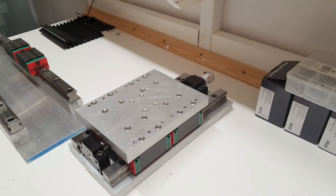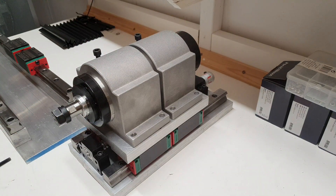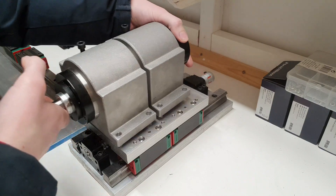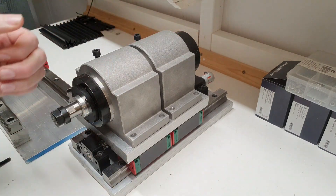These four holes I forgot to make — I don't know why, but I guess my brother and my father were watching what I was doing and I was a bit out of focus — so I did these four by hand, but it worked out great as well. If we place the spindle and the spindle holders, it will look like this. I need to drill one hole in the middle on each spindle holder on each side. But I will do that when I have trammed the spindle in sideways to get it a bit more right.